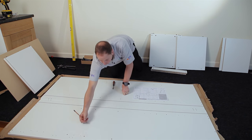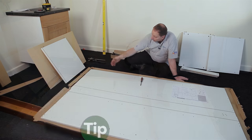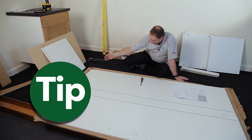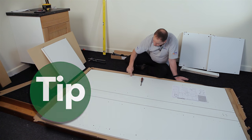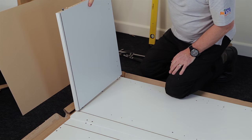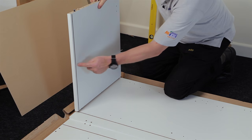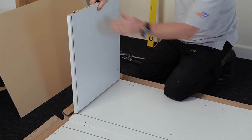I'm fitting a 600mm oven so I've marked it now and I'll transfer those marks onto the other panel. If you've counted up from the wrong end, when you get to the position where you would normally put your shelf for your oven, you won't have the triangle. Taking my top panel, I'm now going to insert it into the corresponding holes, groove to groove, with the hinge holes towards the inside of the cabinet.